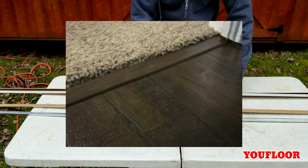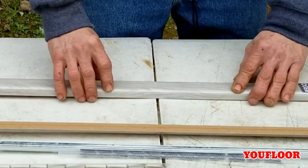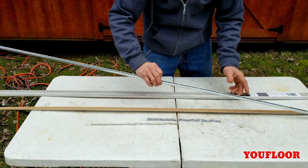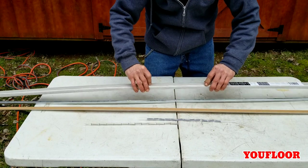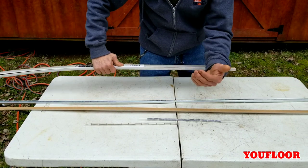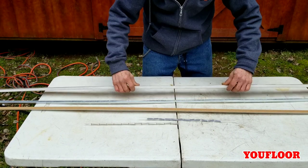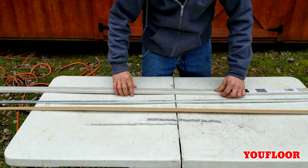When you have the edge of the laminate out in the open — going up against a banister or a fireplace hearth like today — you'll use the end cap piece. The problem I've had in the past with drilling into concrete is making sure the piece is right up against the hearth and that the holes are lined up perfectly so there's no gap between the hearth and the transition molding. So what I like to do is use glue — hot glue and PL urethane — and I'm going to show you how I do that.